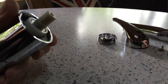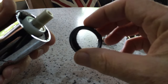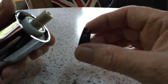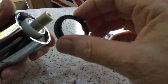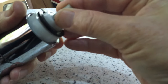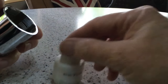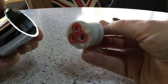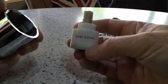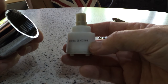This assembly here contains the cartridge, which is held in place by a nut. These vary from plastic nuts, which are very difficult to get off without the right size socket, to brass nuts with two flats which are quite difficult to get a spanner into. But with that removed, you can lift out the cartridge. It has a little washer on the top which you want to put to one side and put back with the new cartridge.